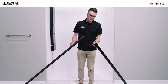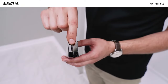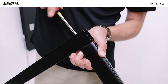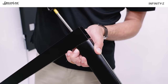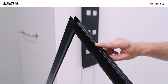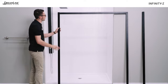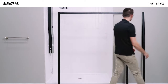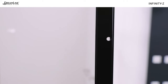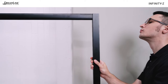Assemble the top and bottom guide rails to the side glass profiles using the 1 inch pan head screws, tightening them by hand into the screw bosses in the guide rails. A little dish soap on the threads will help them go in easier. Be sure the smooth sides of the top and bottom guide rails face out. Slide the wall profiles onto both sides of the frame, being careful to align the holes in both profiles, which are off-center. You should be able to see through the holes in both profiles when done, and be sure they stay aligned for installation.